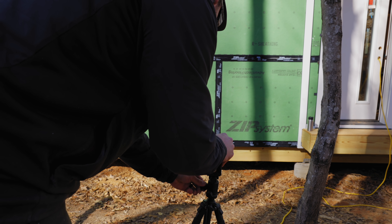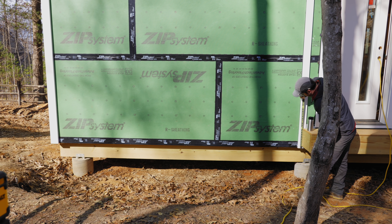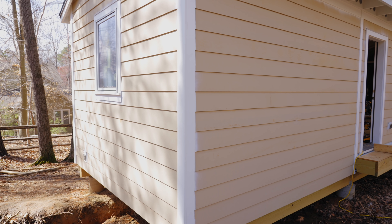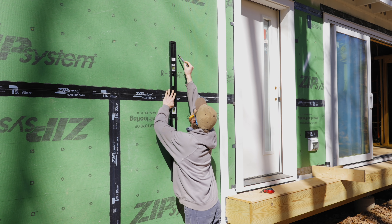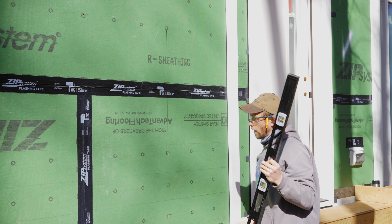Some other tools I used quite a bit in the layout category were a line laser or line level, which we used for checking the level between our trim boards. The line laser was also great for helping us wrap around corners and go across trim boards, making sure all of those boards lined up across the entire house. Also a four or six-foot level is super useful for leveling the lap siding itself, and great for making vertical marks to show where your studs are.